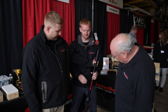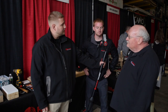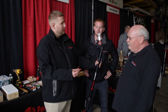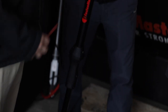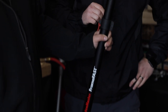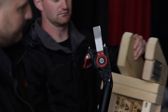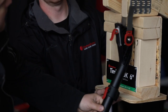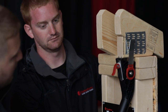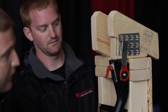So this right here that you're looking at, this is called the FrameFast. This is to replace your hurricane ties. It's a fastener that drives in at the proper angle. You set this between 15 and 30 degrees through the top plates. Is there a degree on that thing to set it at? It's built into it, so it's a muzzle load system — you just drop it in. What you do from there is lift it in place and let it rest up there. It'll set it at the proper angle between 15 and 30 degrees to meet code. This will set it at 22 and a half.